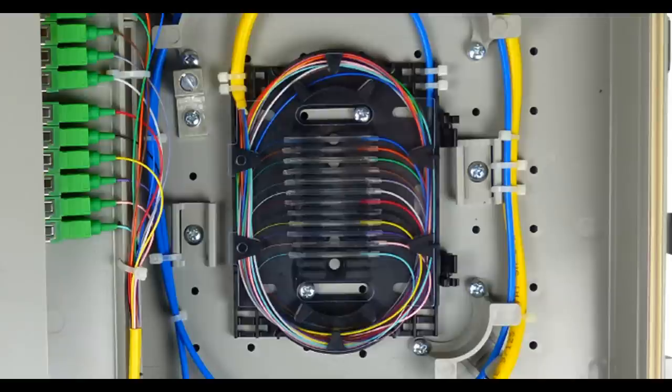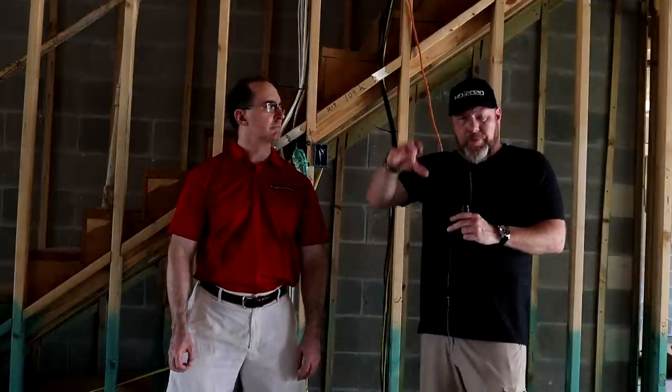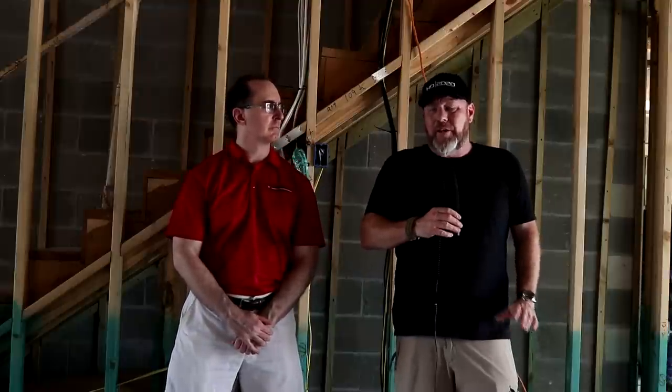So if we ever need to change or upgrade cables, that option is always there for us in the future — something I couldn't do in my existing Audioholics showcase home, but something I can do here. I'm ready for the future. A lot of followers are talking about running fiber, which kind of makes sense when you think about it, but there's just no standards for it. We tried running fiber as a standard to our demarcation runs, and one provider didn't use that multimode fiber, and it was just too expensive to run a multitude of different fibers. For the foreseeable future, the category cables — whether CAT6, CAT6A, eventually CAT7 — a lot of guys are still using CAT5E and still have bandwidth left. The Smurf tube or flex tubing helps with that, though on exterior walls with furring strips it's a little more difficult.